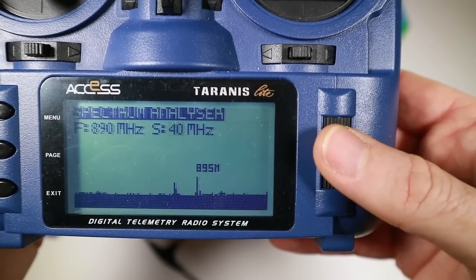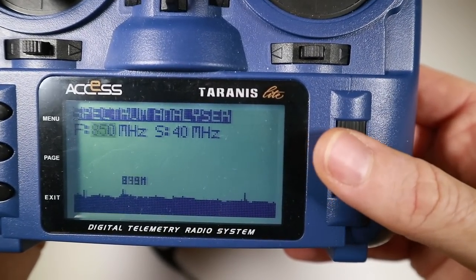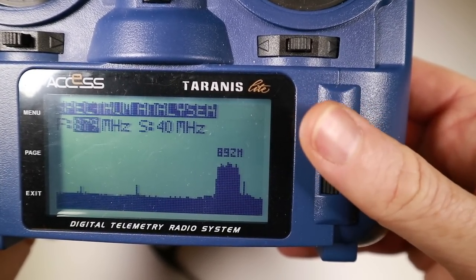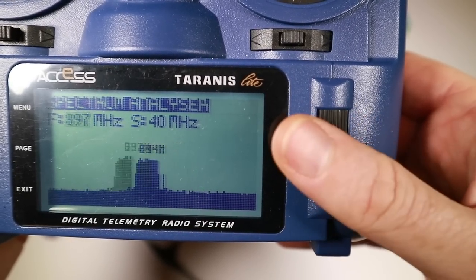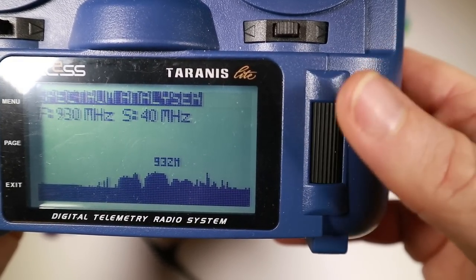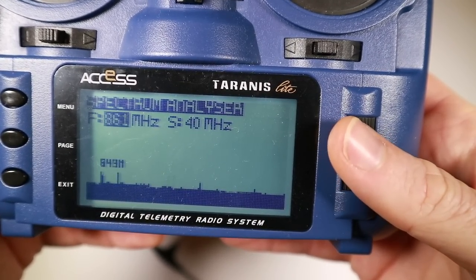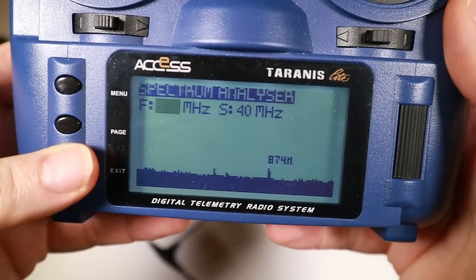What else can we do? We should be able to set the power. Options: we've got 10 milliwatts, 100, 500, and all the way up to one watt on flex, which only uses full power when it has to. I'll leave it at 10 milliwatts for now. Interestingly, there's also a spectrum analyzer in here. You need to turn off the receiver to use it. This is what it looks like around 890 MHz — you can go up to 40 MHz wide. At 868 we can see the noise floor. Going higher you can see some spikes which I'd suggest is GSM, around 890-930 MHz.